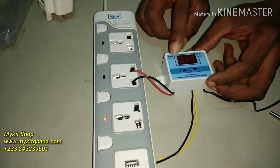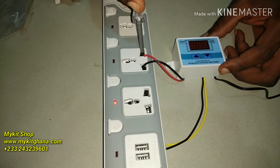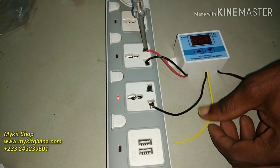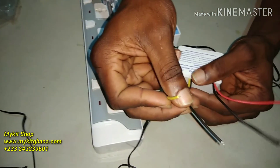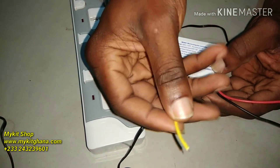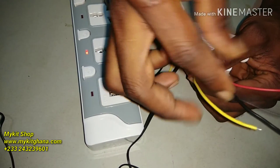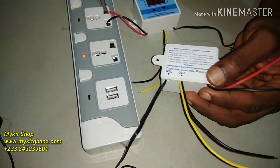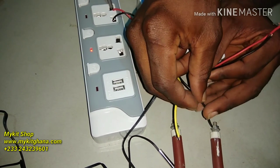So I have the red going to our live. I'm putting the power on. Now for the OUT: the OUT will go straight to your load. If you are using this as a controller for a cooler, it goes straight to your 220-volt fan or cooler — this wire is already neutral and this is already live, so just connect them straight away. If you are using this as a controller for a heater, connect this wire to neutral and this one to live.